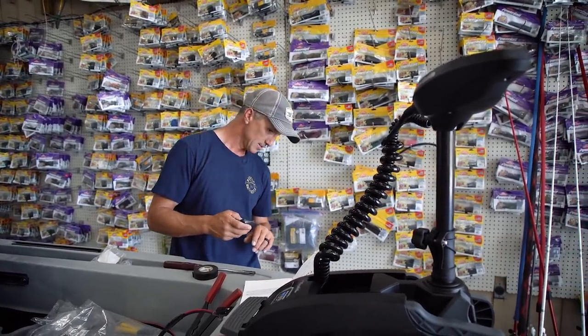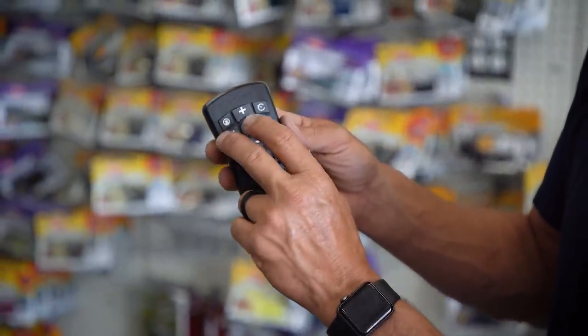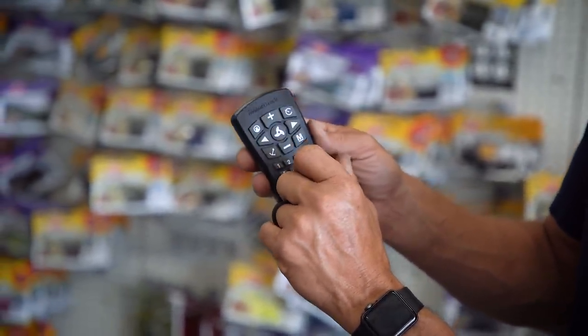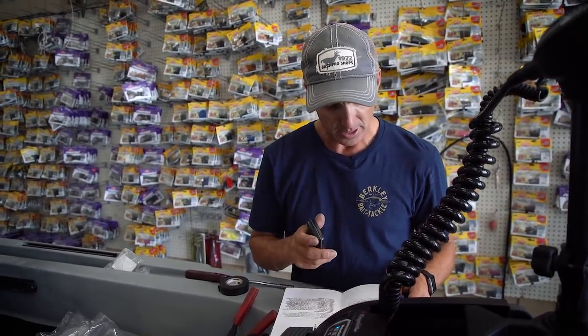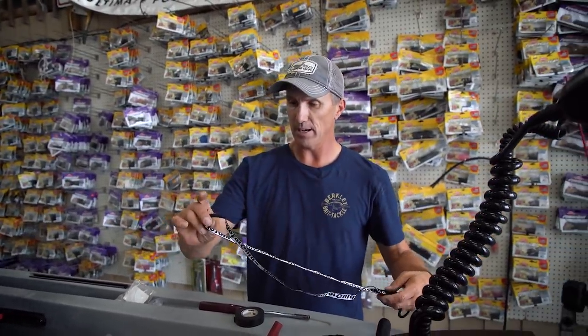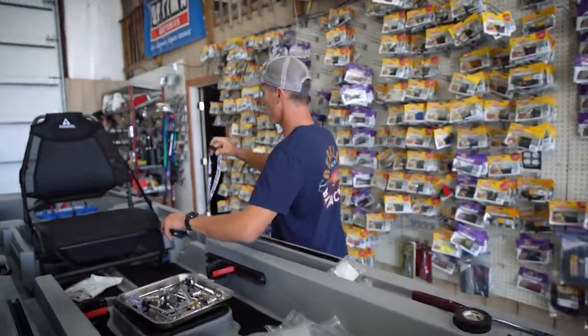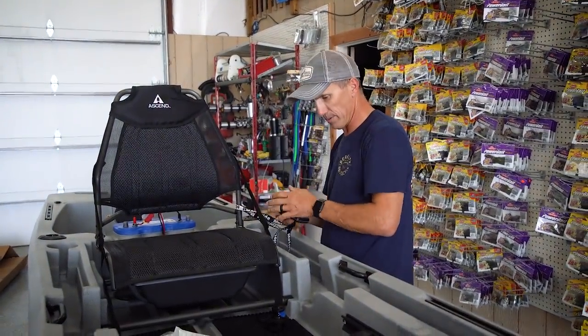Let me figure out if I can turn it off. This is your on/off. From what I've gathered quickly, this is steering left and right, and this is your speed up and down. After reading further, we have to have a fixed GPS position to complete the mounting angle calibration — that's going to be important to do. Once I get it outside, I'm going to take this book with me and do my angle calibration once I get a good signal. I need to put that lanyard on the remote and mount it to my seat so I don't ever lose it.